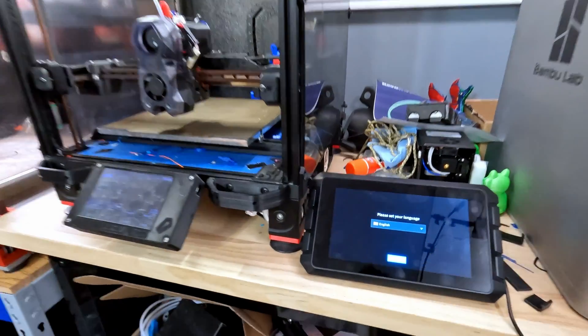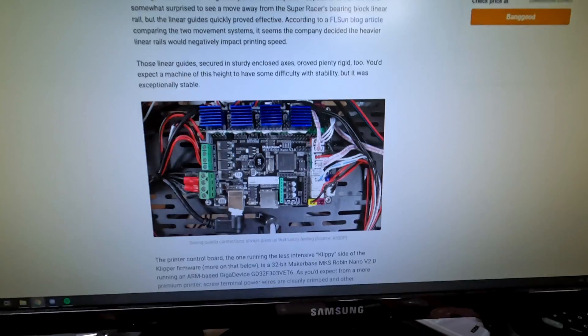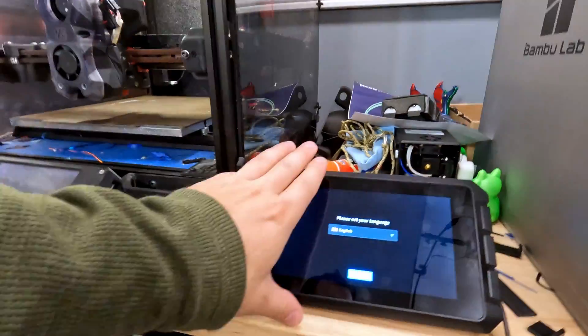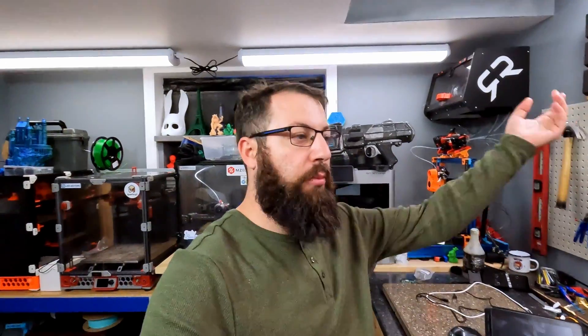That's starting to look like it's the controller board. After some research — the Kingroon and the FLSun both use the MKS Robin as a controller board. So it looks like currently, if you pair a Creality Sonic Pad with an MKS Robin controller board and you do not have a config set up, you will have a thermal runaway right on power up. What I really don't like is that with the FLSun we at least got a warning, but with the Kingroon KP3S there was no warning at all.